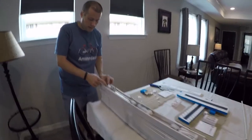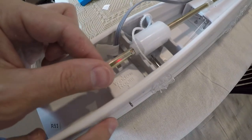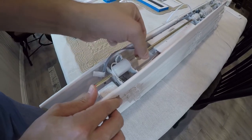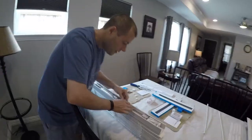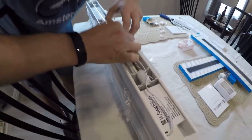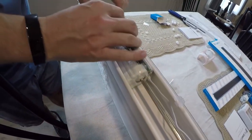Every single pole has this little stopper on this side. You can see this little indent right here inside the shaft, so it's not going to move any further this way. That's where this little rubber piece comes in — you push it all the way here, and now it doesn't have anywhere to move, so it's affixed inside here. Then I'll take this little tiny plastic stopper. You may have to maneuver it just a little bit because it's more the shape of your blind. Pop that in, and now this piece is in place and it's not going to be moving all over the place.